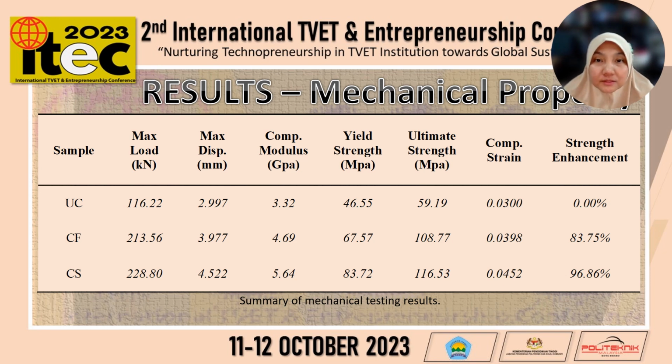This table presents the test result for mechanical properties. The main focus here is ultimate strength and strength enhancement. For the UC sample, the ultimate strength was 59.19 MPa, and for the CF sample, the ultimate strength was 108.77 MPa with 83.75% of strength enhancement. And for the CS sample, the ultimate strength was 116.53 MPa with 96.86% of strength enhancement.